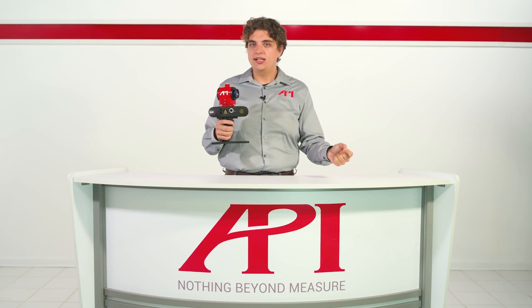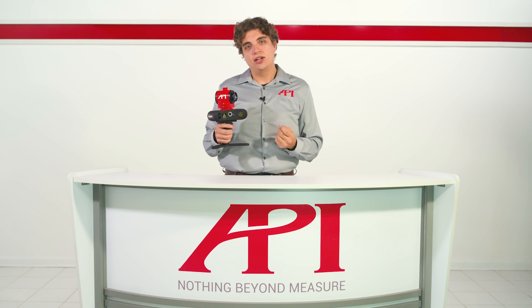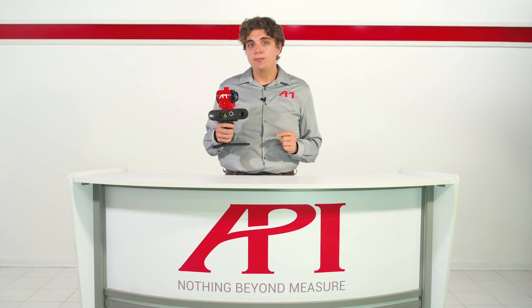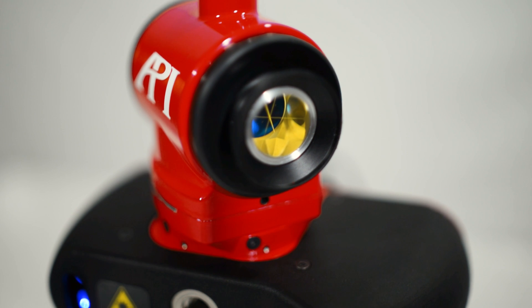But if the laser is not reflected and sent back to the scanner, as with a tracker and SMR, how does the scanner gather information on the features of the part? This is where the cameras come into play. Laser line scanners come equipped with HDR cameras that are focused in the same direction as the laser. The camera reads how far the laser traveled to hit the part, records that information as the laser scans over the part, and saves it to transmit that information back to the tracker. The second camera is a 2D sensor that acts as an SMR, capturing the tracker's beam and sending it back so the tracker can follow the scanner's position in space.